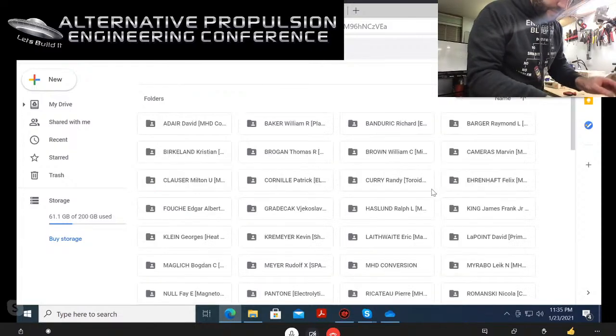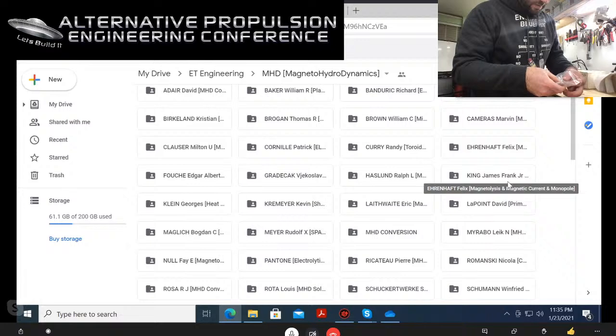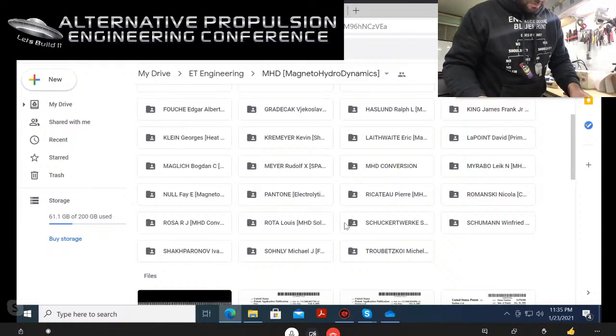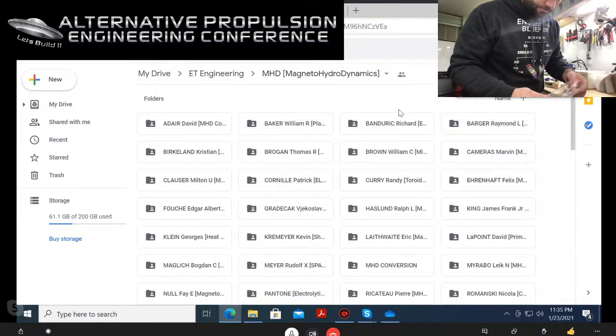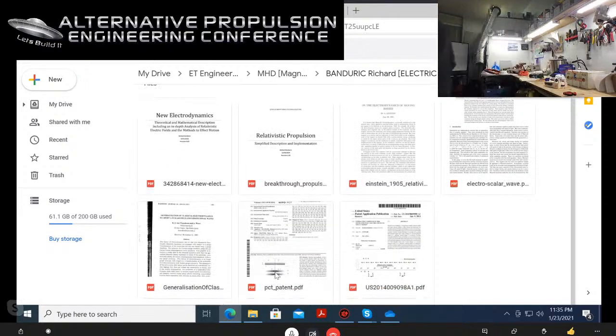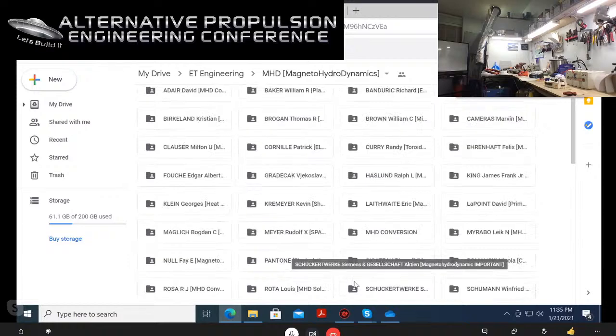Okay, I have these resistors that we use for the Marx. How many of them do we need? I would go with about 10 of those things. Oh, 10. You should be able to find, I think there's still one chain maybe left in there. Well, 10 of them in total. I would use 5 in series and then 5 in series and those two series sets in parallel. And you'll see on the bottom of the Marx I have a bank kind of like that. Only I use 8 plus 8 in series, so 16 in total. But you don't need that many for what you're going to be running there.